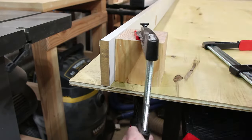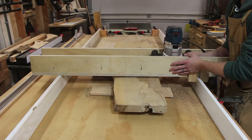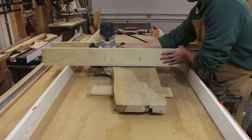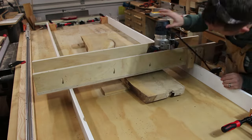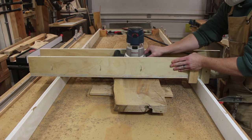The setup on my DIY sled was pretty simple. I just used two MDF trim boards as guide rails and clamped them square to the table. The sled then sits on top of those rails and slides back and forth while the router slides within the sled. As long as your indexing surfaces are clean and smooth the final product should come out nice and flat. There are some issues though — sometimes when you're sliding the router in the sled you can get some vibration and chatter in the cut if it doesn't slide super smooth.